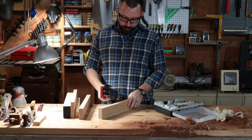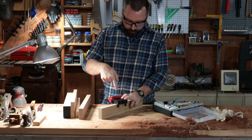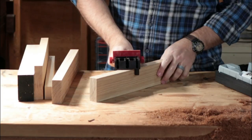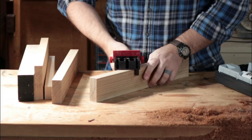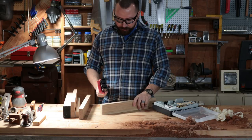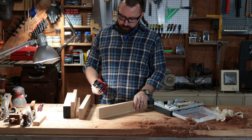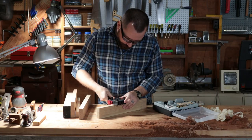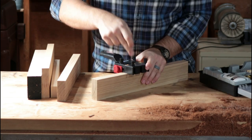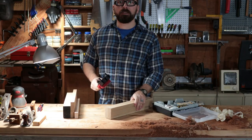So depending on the size of the hole you're trying to drill — whether it be 5/16 or 3/8 — you basically put that in here and turn it to the side, and that middle hole is going to be centered on the edge, and you would drill down. For the smaller holes, you would do it to the side like that, put it in and kind of squeeze it to the side, and you're automatically centered on both sides. For the smaller holes, you are somewhat limited on the thickness of your wood. Another way to use it is to figure out where you want to be, tighten that down, and then you can drill your holes and repeat it on multiple pieces of wood so that when you join them, they're all in the exact same spot.